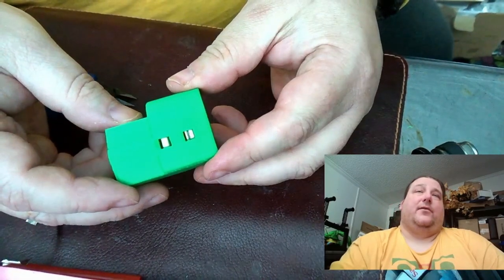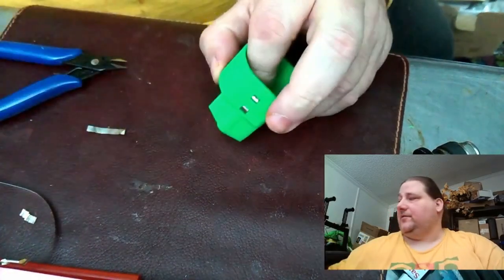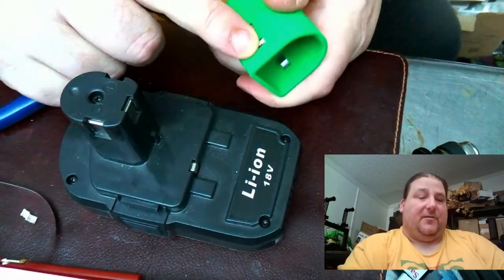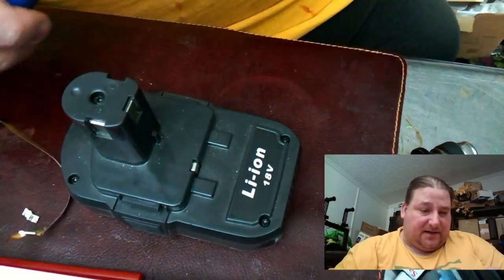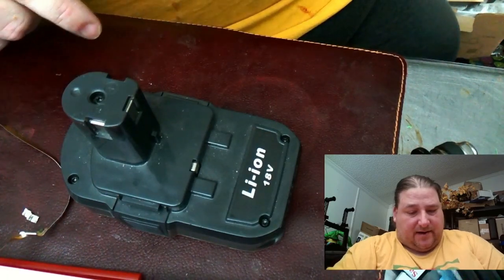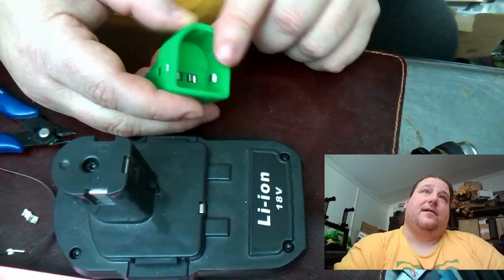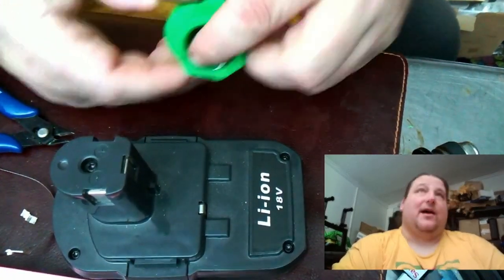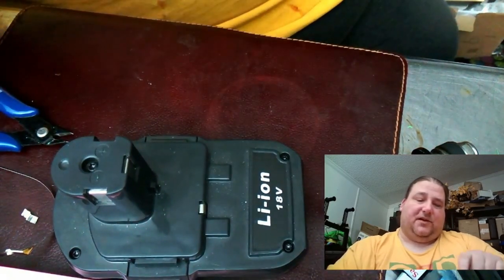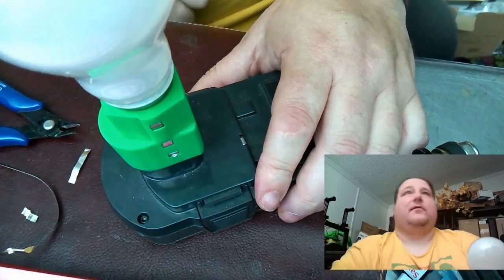Now you have your positive contact, which is going to touch the battery here. There's nothing on the back of the battery, so you're not going to short anything. It terminates here and it terminates here. This side — snip off that little bit sticking out, otherwise it'll cut you. This one here goes around this contact, up and around through the slot, out around one of the threads. So now when you put the bulb in, the side of the bulb touches this contact here and the tip of the bulb touches that contact down there. Then you just plug it into your battery — that's all there is to it.